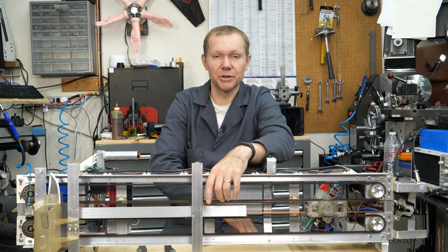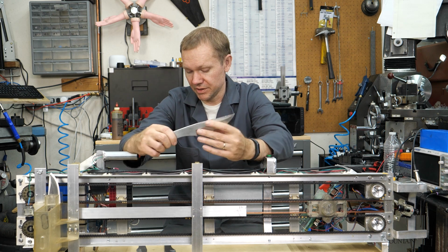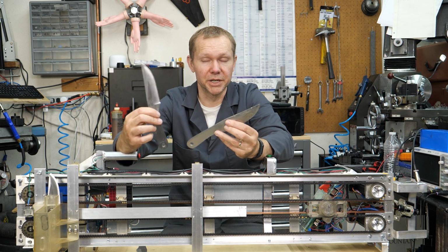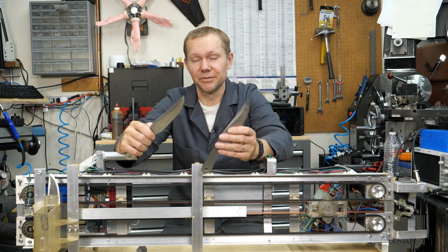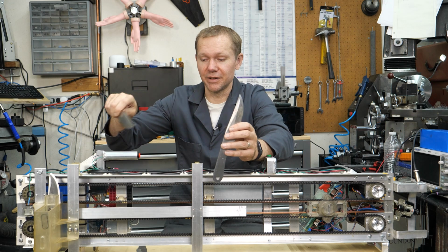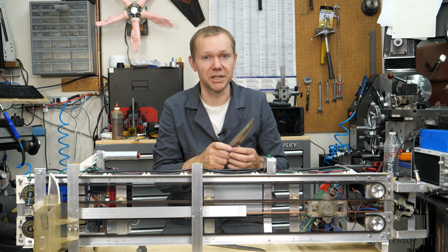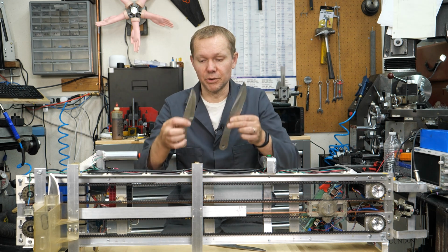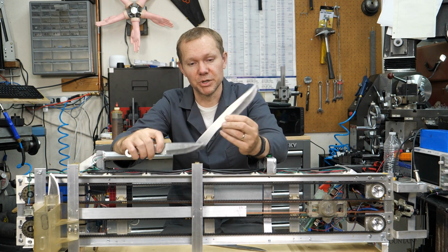And you may have noticed in the video, this is one of the knives. These are the two knives that I learned to throw when I was in high school, and they are too heavy. So through that spreadsheet of the F equals MA, the M is too big on these knives for these motors. I would have had to step up to an even bigger motor, and then how fast can they get up to 6,000 RPM? You can't buy these anymore anyway in this particular size.